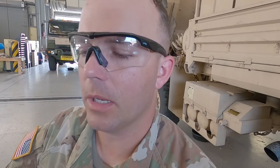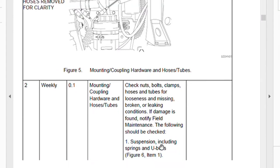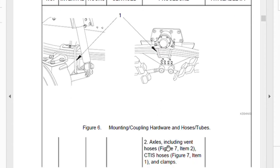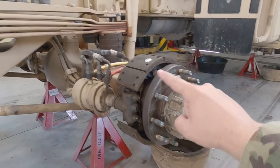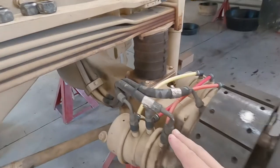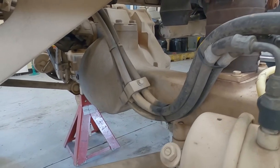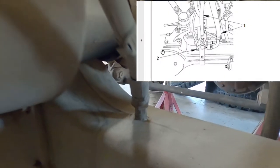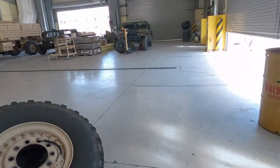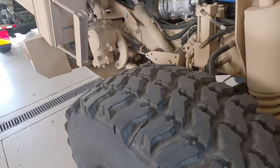On the weekly portion, we've checked the air system including the air dryer and air tanks to make sure they're retaining air. Number two is checking the nuts, bolts, clamps, and hoses — suspension including springs, axles including vent hoses and the CTIS. I went over to another truck with the tire removed to show you the hub, the brake assembly, and the axle itself. The whole assembly holding the two wheels together is the axle. The differential in the middle — commonly called the pumpkin — has an air breather at the top. That hose on your axle allows for expansion of gases as you drive and it gets warm, releasing pressure so it doesn't cause a seal leak.